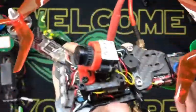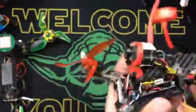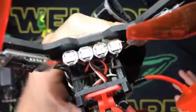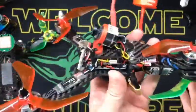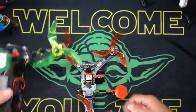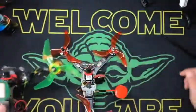Omnibus F3 power distribution board, it's got OSD, 1000TVL cam, 600 milliwatt transmitter. Flies like a dog on fire, just for shits and grins. I did put some cool Knight Rider headlights on the front, which I usually don't do, but it was fun. My ESCs are tied to the side. This one, the drone, actually has a 4-in-1 ESC, which makes life a little cleaner on the arms, obviously.